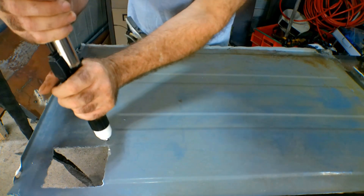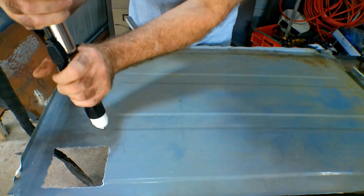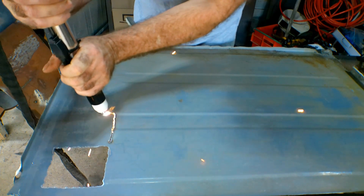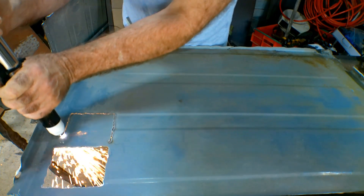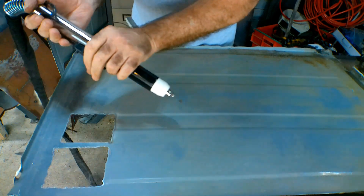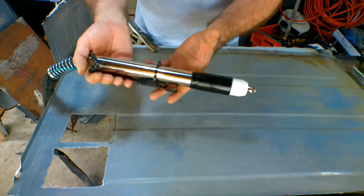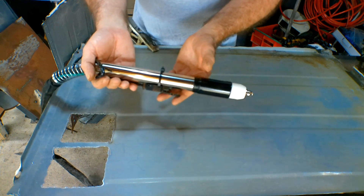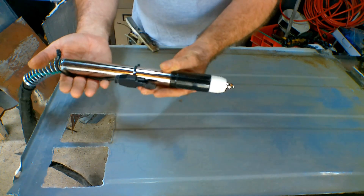Bear with me on this demo, guys — it's pilot arc so I don't have a guide to hold it up; I've got to hold it off the metal and try to keep it at the same distance, which is really hard. Looking good! It's really hard to hold it at the right distance, but if you have it at the right distance it's a really nice torch — you can really see it working. Really nice torch, and like I say it's cheap as well. If you can squeeze out 50 or 60 amps and set this up, it's pretty awesome. Torches cost about $45 to $55 with a lead, but you can make your own lead if you want — I've got other videos on that. Really nice torch, latest model.